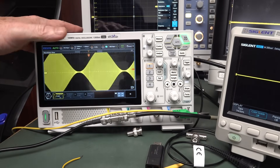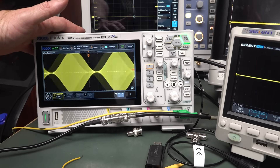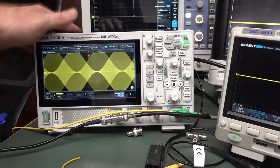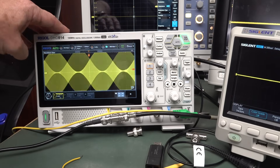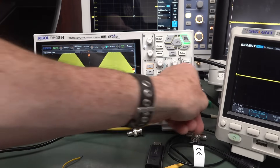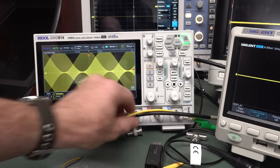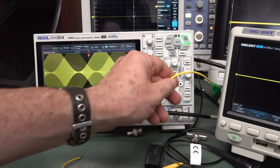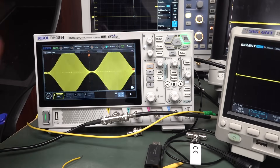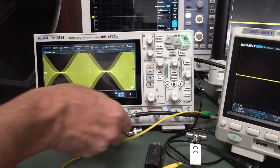And of course it is going to make a difference. I'm pretty sure I've done a video on common mode noise on scopes. The fact that this is not grounded — that's why they actually provide you with a grounded lead. If you have any sorts of issues like that, and of course safety as well, but also for mains earth referencing to get rid of any external stuff like that.